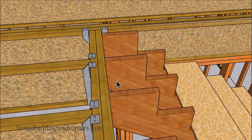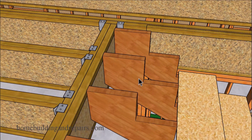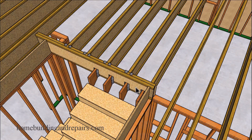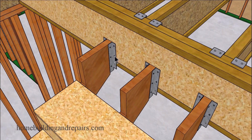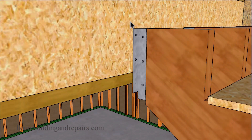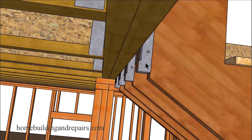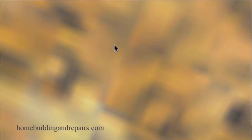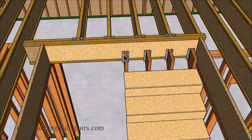This creates something that we will actually be able to put some nails into to connect our stringers to the joist. This is a method I've actually used before and haven't had a problem with. However, another method I haven't used would be to use some type of building hardware — this is actually one of the recommendations from one of the larger truss joist product manufacturers. However, they did not provide any recommended building hardware for attaching the stringers to the double truss joists, so you might need to check with a structural engineer or local building authorities for a hardware recommendation. Ultimately, I think what an engineer or product manufacturer is hoping for is that you will attach this to either a rim joist type of material or some type of an engineered beam.